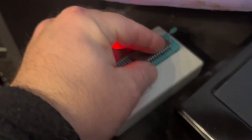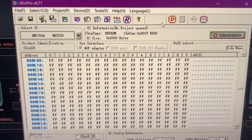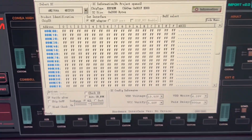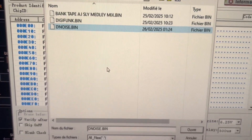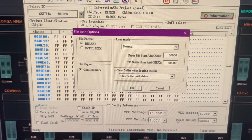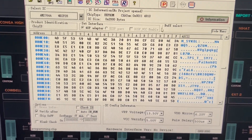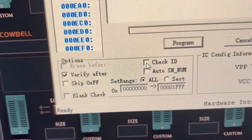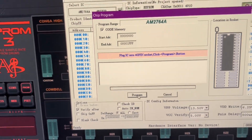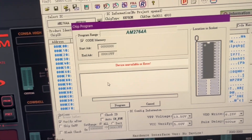Place the chip where it should be and lock it in place. Now with this little interface you should be able to write. I'll open the file — user converted, denoise — that was the one. This is the actual file created by VIProm, so I open this binary. Now it's in memory and we're going to program the chip. You might need to uncheck ID — sometimes it won't work with that checked, it can be picky. We have an error, let me check why.